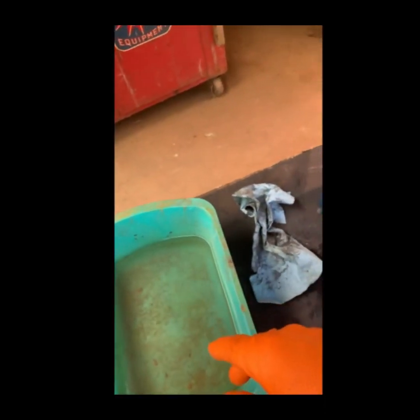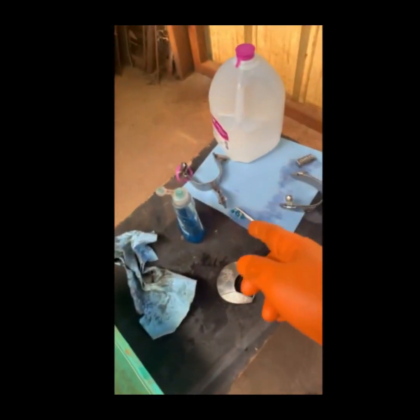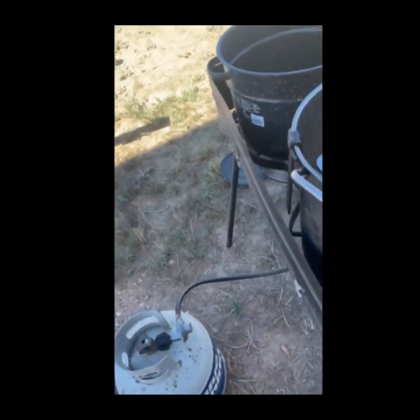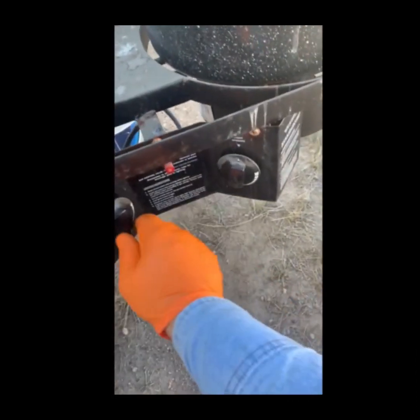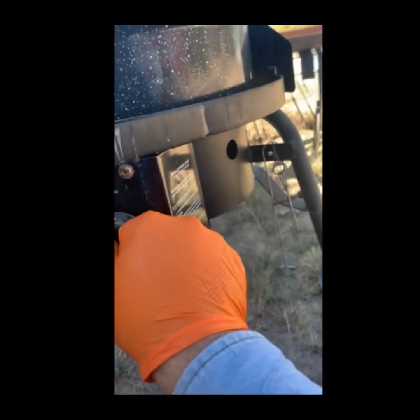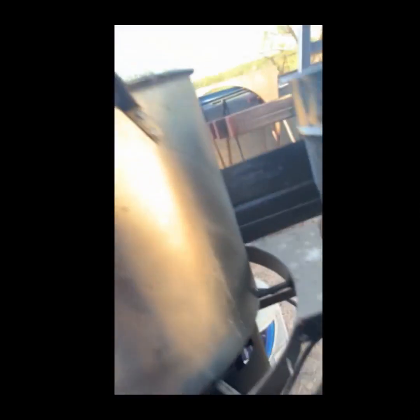We clean the buckle up real good in the Dawn solution. We cleaned the spurs up that we're doing in the Dawn solution. All of this is done before we start our bluing. You want to get all set up and organized. This water is distilled water, not tap water — you want to use distilled water so you don't have any impurities. You also want to use distilled water in the pot on the right side that's boiling. You don't want any impurities like salts in your clean water. Now I'm cranking everything up, lighting it, and getting my fire going on both sides.